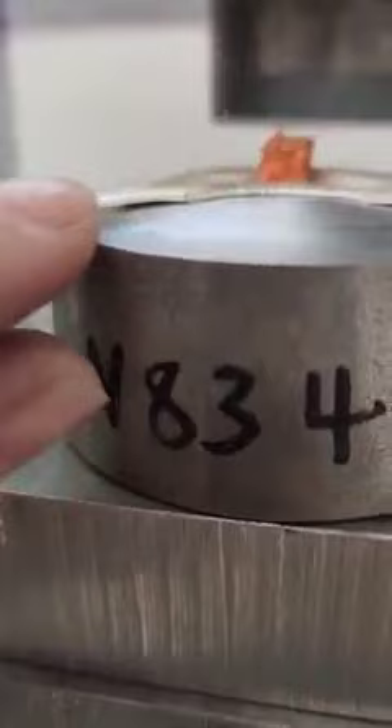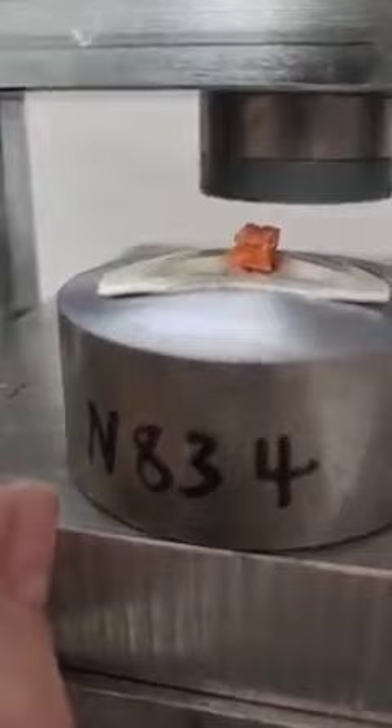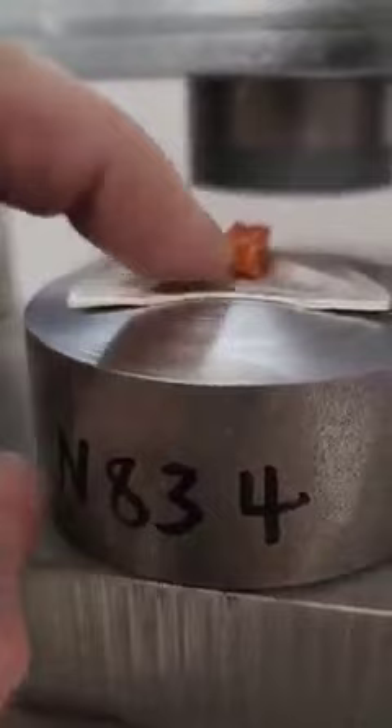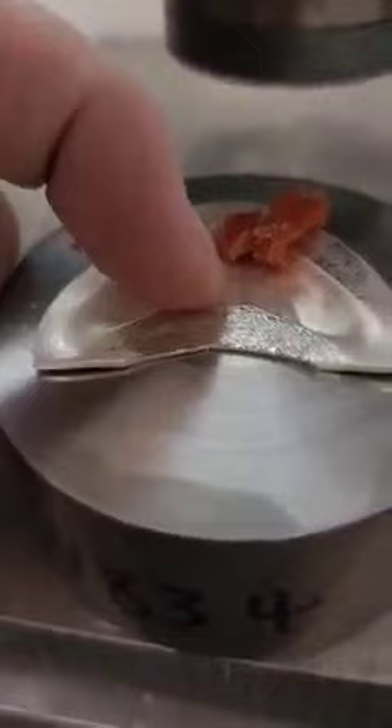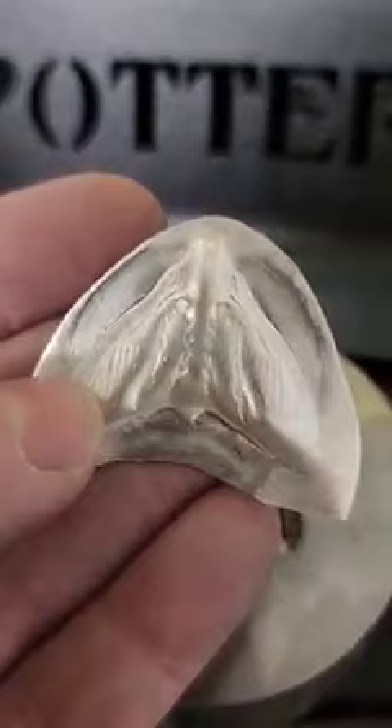This time I went a little bit too far. You can see here's a good example: this is the thickness of my metal, but because I applied a little bit too much pressure, the tool steel pusher pressed against the metal right here and it has thinned down to almost half the thickness of what it was previously. So I'm going to have to be extra careful when pressing the tail of the moth to make sure I don't tear the metal there. There's a little bit more detail, but not quite enough, and this area is fairly work hardened, so I'm going to go ahead and anneal it again.